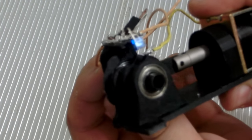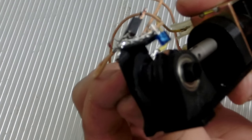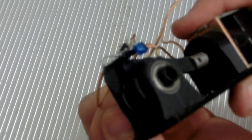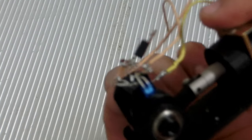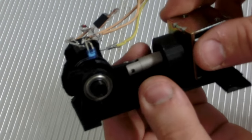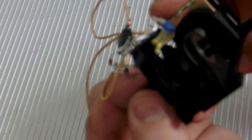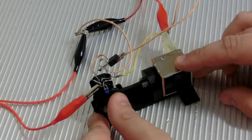The working principle is very easy to understand. If the light beam gets broken, the magnet turns on. And this is what it's doing. But since it involves so many parts and sensitive parts like the emitter LED, it's hard to make it run on higher voltages. Since this motor will run up to 60 volts later on, I discarded this solution pretty quick. Let's see if it works. The first test run.